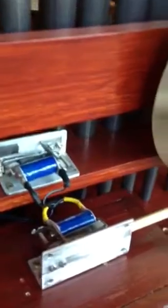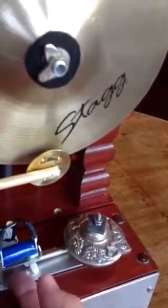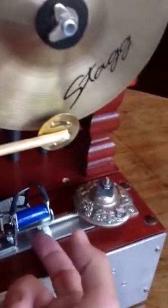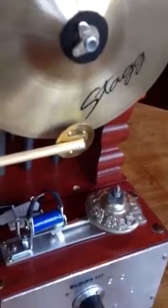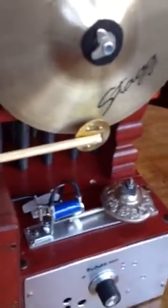If you tried to operate them differently it probably wouldn't work. These use about 200mA — pretty light on power and they work quite quickly. I'm sure there are better solenoids out there, but the ones I was trying used too much power. We've also got a bell which rings — it actually sounds better in real life. This is a Tibetan bell. I put various washers under here with a piece of foam to give it the right balance of damping. The thing with percussion is it can sound truly dreadful on some pipe organs — it can literally dominate the whole thing. So these are fairly tame and quiet, not too harsh, and they fit in with most tunes.